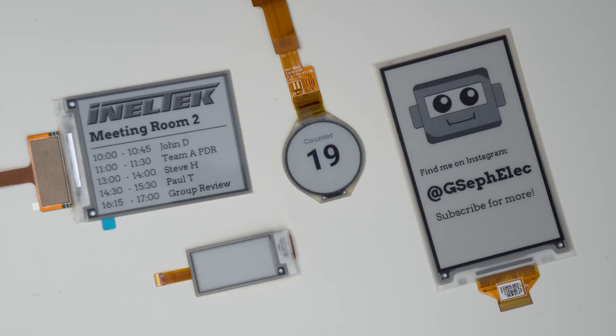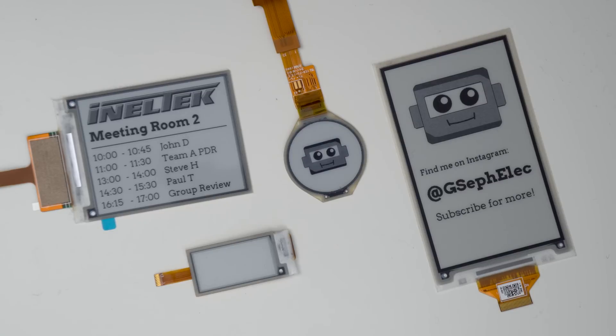Here we have a 2.8 inch display on the top left, a 1.1 inch smartwatch display in the middle, a 3.7 inch display on the right, and a 1.3 inch display on the bottom left. We can see the 2.8 inch display perform a full update, which is fairly fast in comparison to the 1 to 2 second update we saw on the simple AIO displays. This is then followed by a windowed update switching the text between 'John D' and 'in progress' — performing a full update but only in a windowed area. The 1.1 inch display's full update is quite quick and we can then see it counting up by performing partial updates so the change is instantaneous. Partial updates are quicker and look nicer, but they often leave a ghosted image of what was there before — that's the trade-off between update quality and update speed.